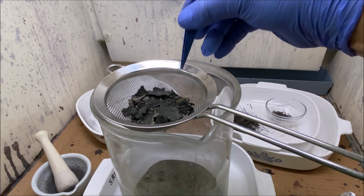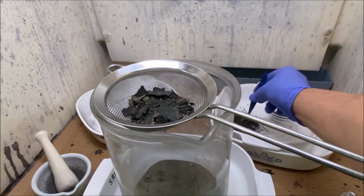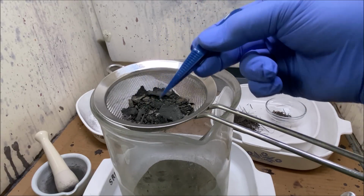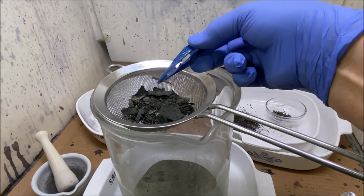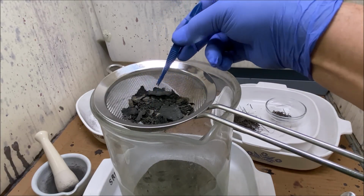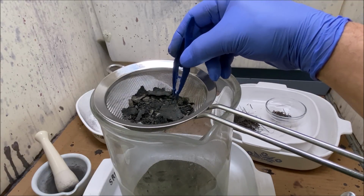Still some pieces of steel in here we can take out. Watch batteries. Just go through and pick out all the stuff that we don't want going down into the beaker, because if we allow this steel stuff in there, the nitric will partially dissolve it, but it'll make for a real dirty solution. So we want to go ahead and just spend some time and get all these pieces of non-gold stuff taken out of here before we proceed.